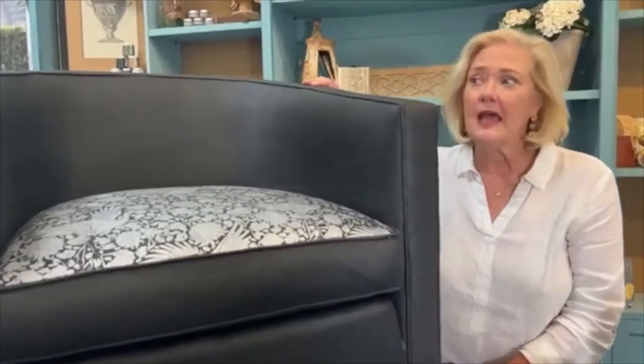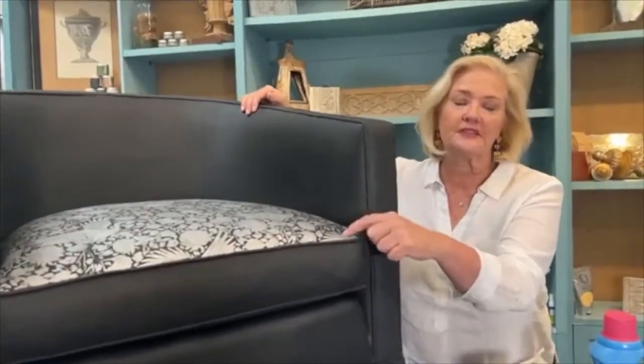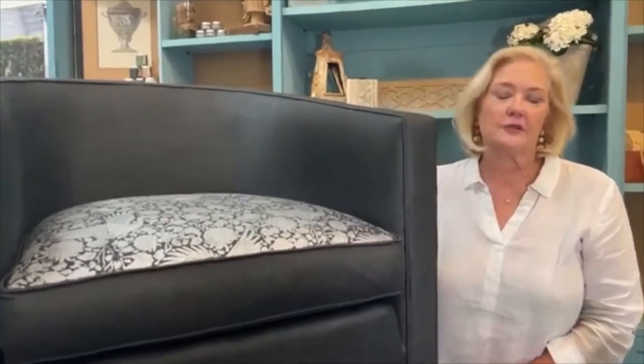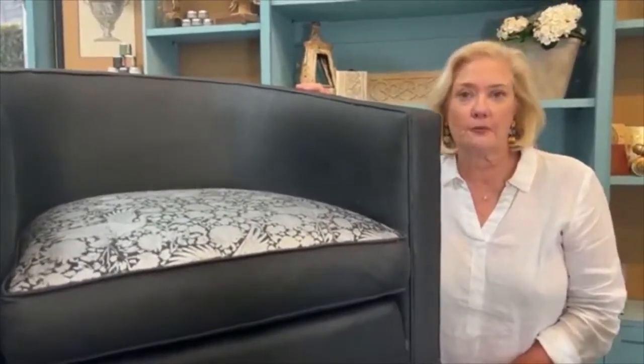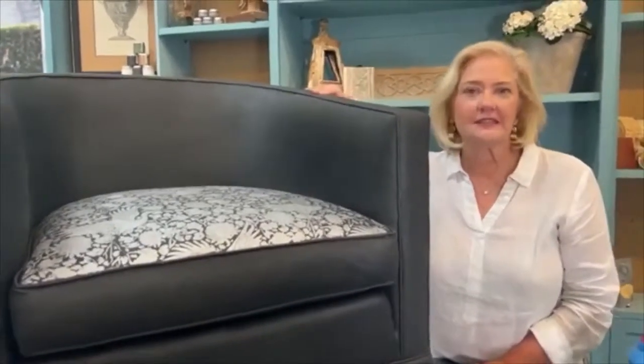But the other thing is, maybe this is something that you want to do for outdoor seating. A lot of people don't realize that you can paint wicker, you can paint a lot of the plastic, you can paint metal, and then paint your cushions, and you've got a gorgeous piece. So we did allow the silver metallic ink to dry overnight, and then once it's dry, you can wax your entire chair with the Mind Your Own beeswax and buff it just a little bit to a nice sheen, and that way it can sit outside.